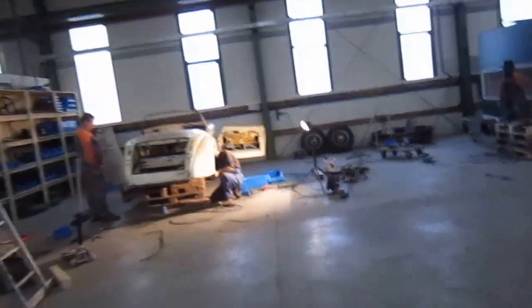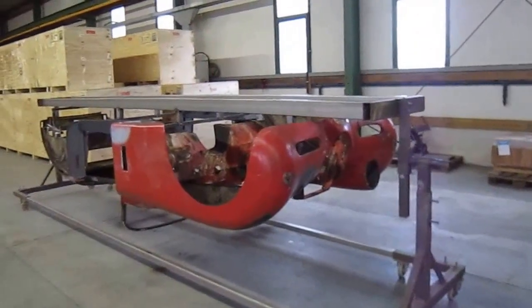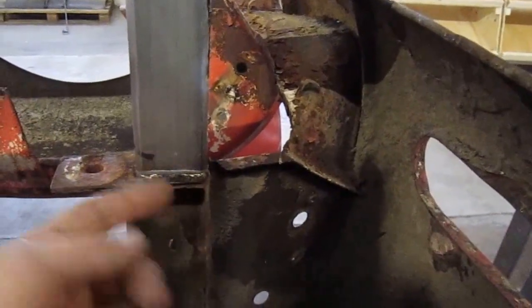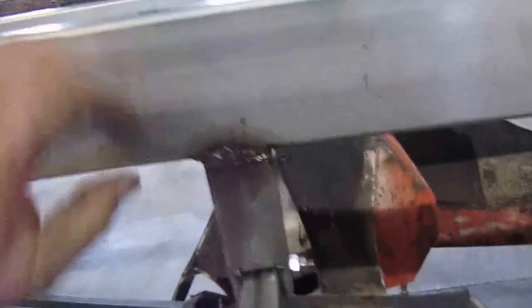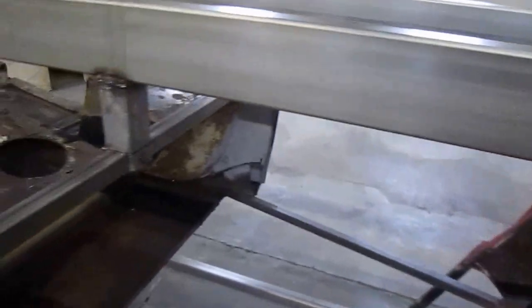Just finished this off today, and then we'll take this car off and put the white one on — just to check these fittings. Basically what we did with that one was we made a plate for it and then welded a nut on the inside as a captive nut, then put the bolt through underneath, as you can see there. And these ones — it's stainless, which is nice — but welding stainless and ordinary metal together, you have to get special rods for it.